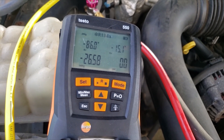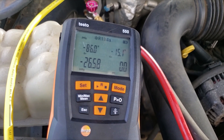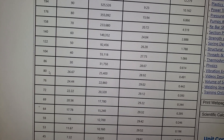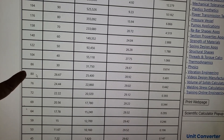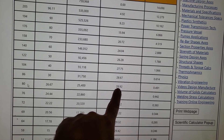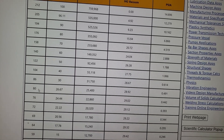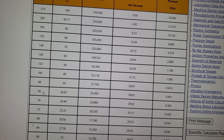So I'm going to do a pressure test — add some nitrogen to the system and a trace bit of R134A so I can get my leak detector on this. I'll be back when it's at minus 29 hopefully. What we're looking at here is the boiling point of water at a specific temperature based on variations of vacuum. It's 80-81 degrees outside right now, so we're going to be looking at 28.92 inches of vacuum. If we get stuck there for a very long time that means there's plenty of water and moisture in the system that's boiling off. Once all that is boiled off, the vacuum will start creeping back to a deep vacuum.